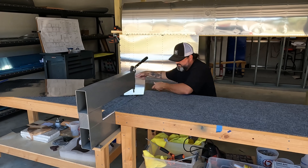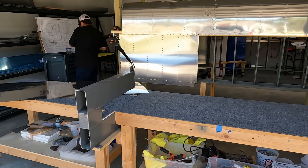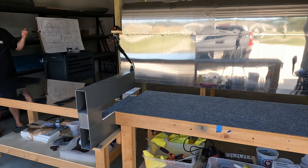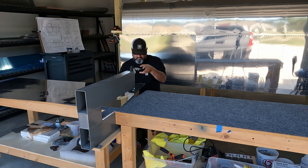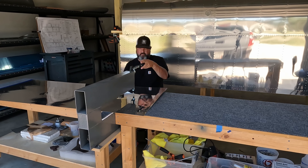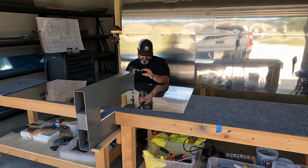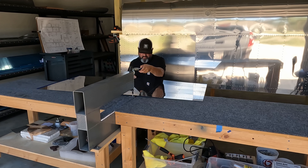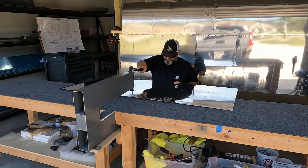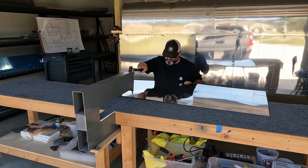The aft spar is kind of strange. On the top of the wing, the flange bends toward the trailing edge, and on the bottom of the wing the flange bends toward the front, the leading edge - so it makes kind of an S or Z shape. Those flanges are not at a 90-degree angle; the one on top bends a little past 90 degrees, and it feels pretty uncomfortable to use the squeezer to dimple it because it feels like it's relieving that bend, taking some of the bend out of it. It's not substantial, but it is bothersome. I've just made peace with it, and if I feel there's a section that's bent out a bit, I can take the hand seamer and gently put it back in place.